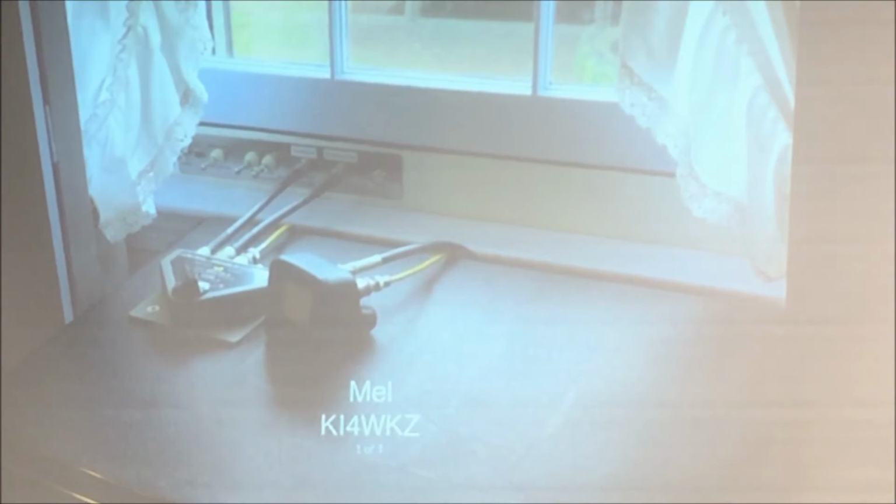Okay. Anyway, this is a very simple system. I've got 2 antennas outside. One is a multiband vertical, and the other is a fixed 40-meter dipole that I use for the digital net. Basically, that cable right there goes down on the floor into this closet, which is really what my Radio Shack is. It's just a simple bedroom closet. And anyway, there's the vertical antenna, which is this one, and then the horizontal antenna. There's an antenna switch. That yellow wire goes from there over to the power meter.